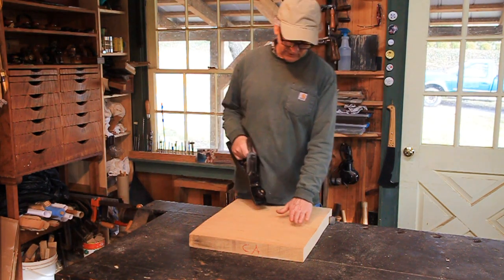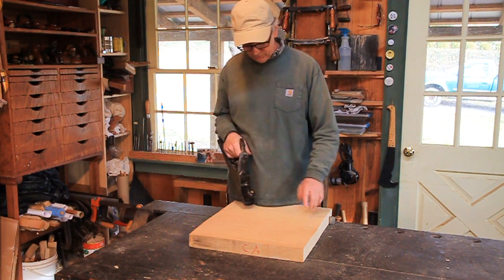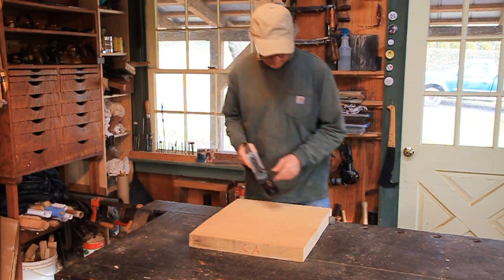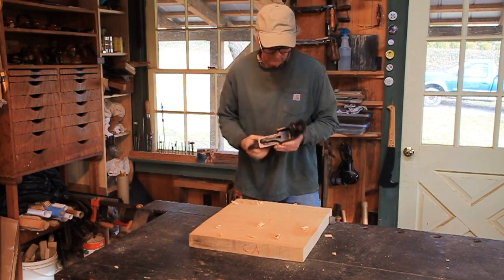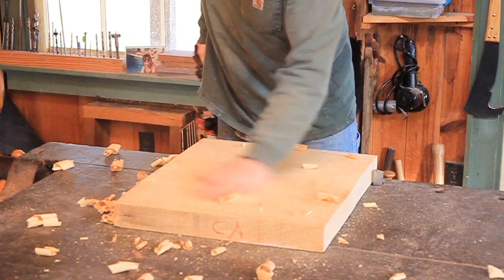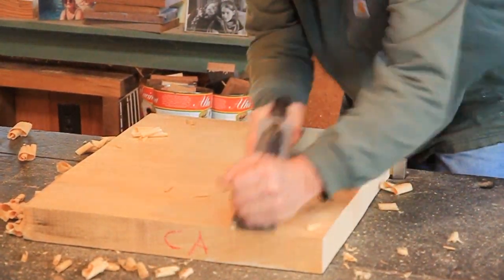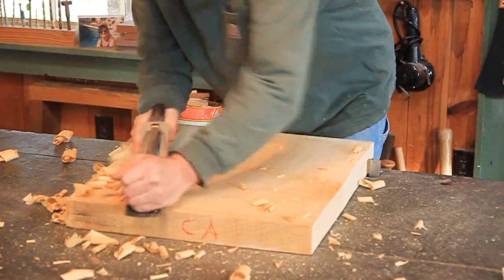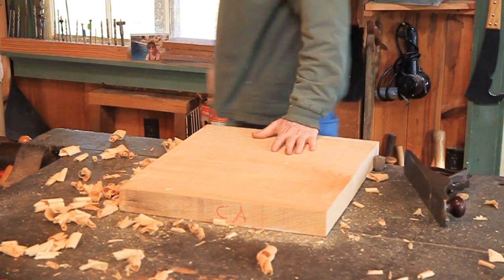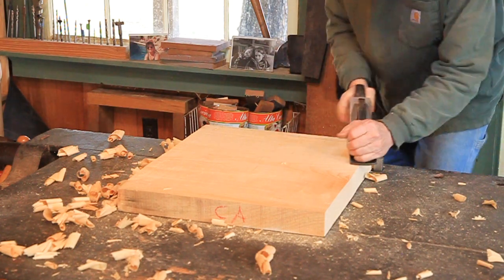Now I'm going to cut cross grain — either straight across grain or diagonally — because the wood has less strength that way, so you can take bigger cuts. I'll see how this plane is set. It had just a little crown to it there — take that little crown out first. Let's grab a straight edge and see what I'm looking like. Still a little bit more.